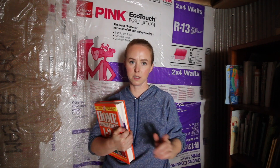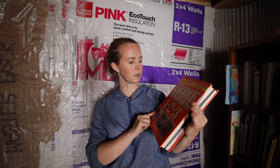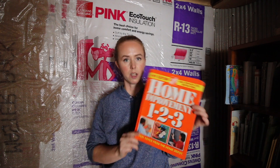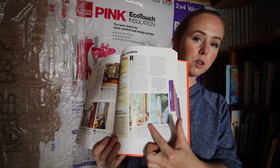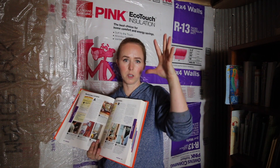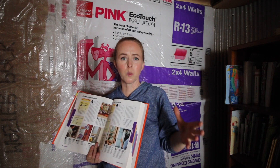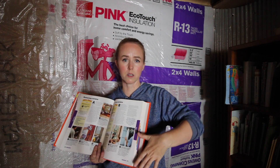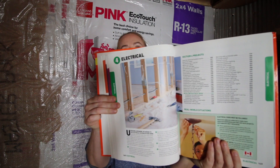If you don't have a dad to come show you how, or a friend who's seen it done, here is the book I really like — it's an older book, 'Home Improvement 1-2-3,' second edition. I like it because the pictures are really good. You can see what kind of support you need to put underneath so you're safely holding your window up. If you don't have enough supports, all you have on the outside is plywood and a little bit of siding, and the weight of the house can make it settle. If the plywood gets wet, you're going to have problems with settling. This book goes through everything — flooring, ceilings, electrical, insulation. Really great book, and it'll be in the link below.